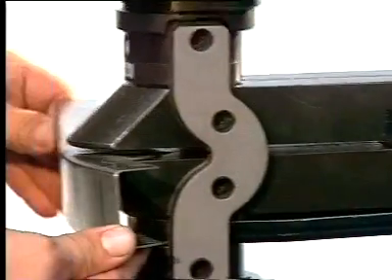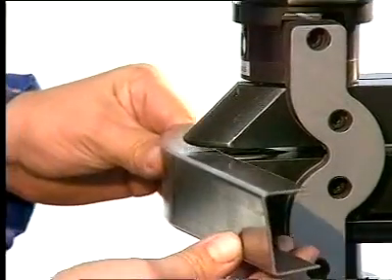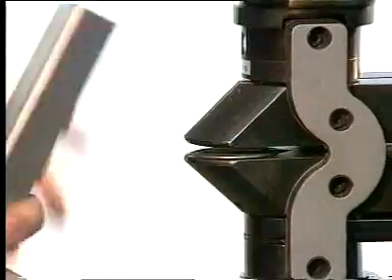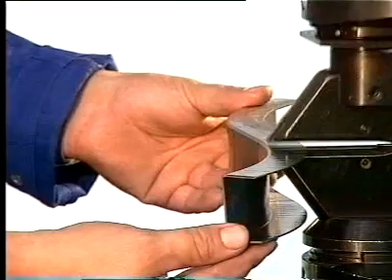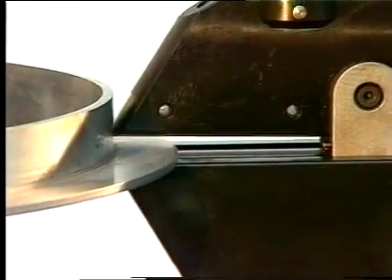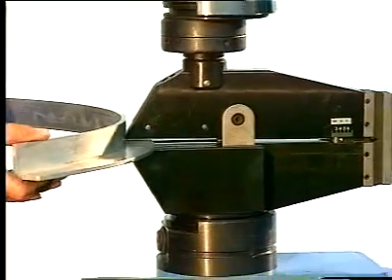The beak-shaped tool is essential for shrinking U-shaped and acute angle sections. The working surfaces are provided with steel studs or laminated forming dies for gentle treatment of aluminium and stainless steel surfaces. The counterpart to the previous tool stretches the section to an S-profile. Using the same beak-shaped tool, this aluminium angle section is stretched into a curved shape. The biting surface of the tool reaches right into the angle, resulting in outstanding precision and high tolerances.